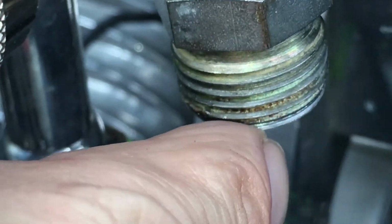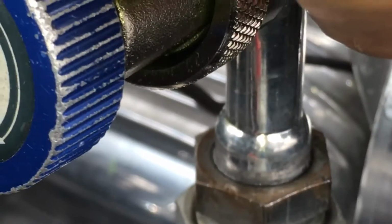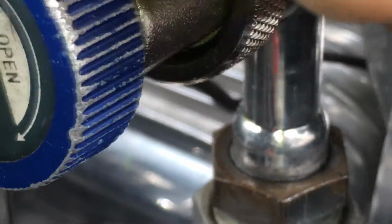Let's get over there. Where that touches right there, that little edge has been smashed. It's like a razor. It's actually smashed. The metal has been annealed. It has been over tightened, and it should have a nice smooth surface. So I put a little NYLOG on the back side of this to act as a lubricant, just to help on that axis. So now it spins nice.